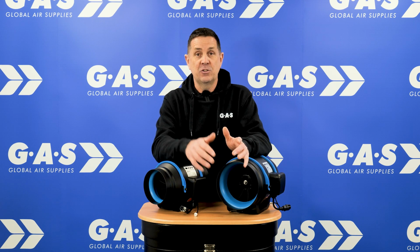The only noise you generally get from a fan is the air noise. So by reducing the air noise on a box fan, it means there's nothing literally coming out of there when you put a filter on. That's why you've always got to over-spec the box fan to twice as big as it should be just to move that amount of air. Then you've got to put a control on them. That's why I don't particularly like box fans.